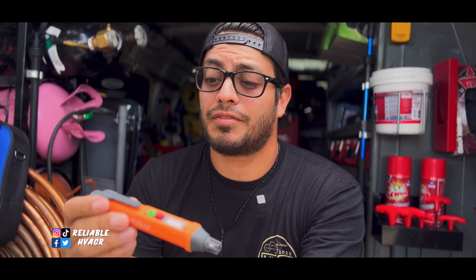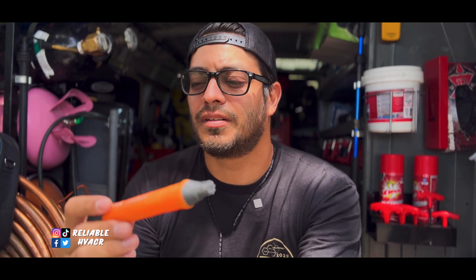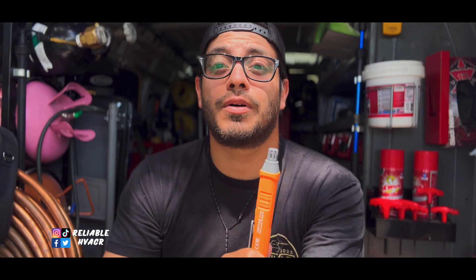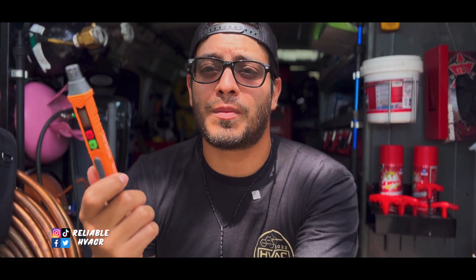Dave already beat me to it, in case you saw his video. I had this idea after contemplating whether I wanted to review this or not — I wasn't sure if it was going to work that well, but it looks like it does. I need to go purchase some R290 because I don't keep it in stock. That topic came up on my live stream — I've only seen one R290 unit I got called out to, a couple months ago when I had a leaking small reach-in cooler. I was able to find it with bubbles, but had to hose down everything. This would have helped me pinpoint where I thought it was.